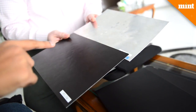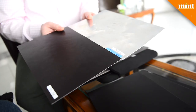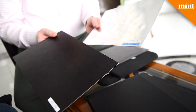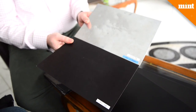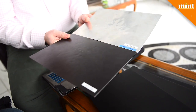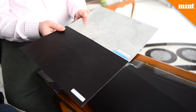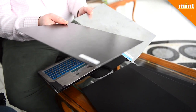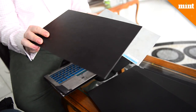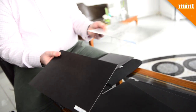In the course of various demonstrations over the past two or three years, I've dropped a billiard ball on these exactly the same number of times. You can see the dents in the aluminum, but you can barely see anything on the carbon fiber. Even where it has dented the top, it doesn't punch through to the bottom and it doesn't break the screen — that's why we use the carbon fiber. If we can make the thing last longer by being more durable, that means we ultimately pay less in warranty costs.